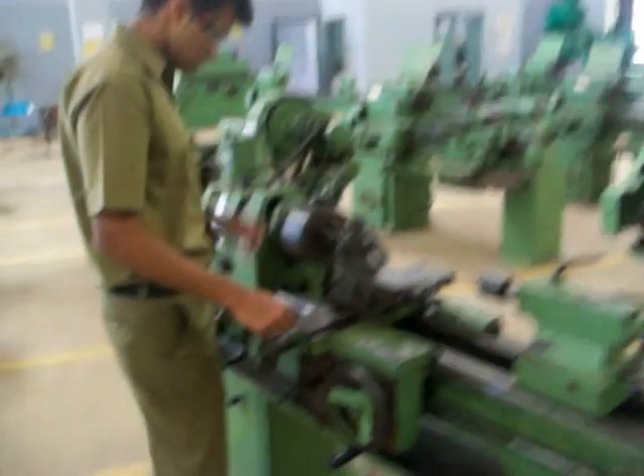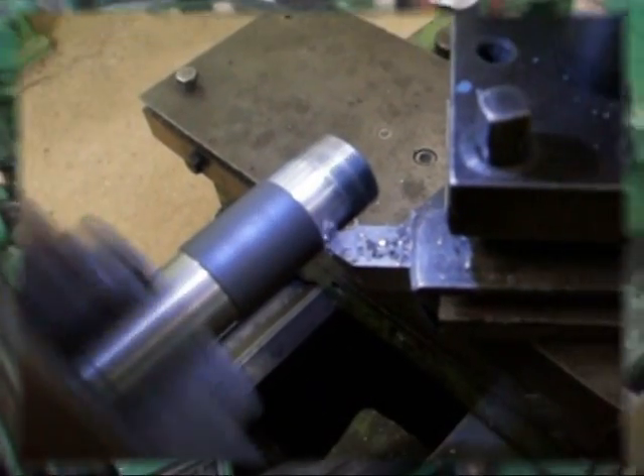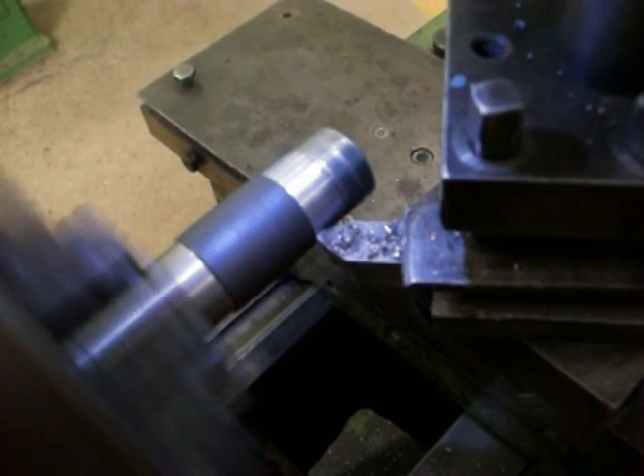Let's have a look. The portion of material that has been removed from the workpiece is called a chip. When the tool moves against the workpiece that is fed, the material is severely compressed at the area of contact of the cutting edge with the metal. This will tend to high temperature shear or plastic flow depending upon the ductility of the metal. When the compressive force by the tool exceeds the ultimate strength of the metal, the metal particle at the metal-tool interface will shear to form a chip. This phenomenon is confined to a narrow zone ahead of the cutting edge and is called the shear zone.